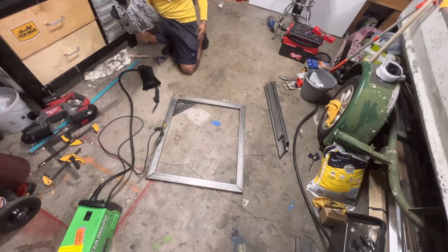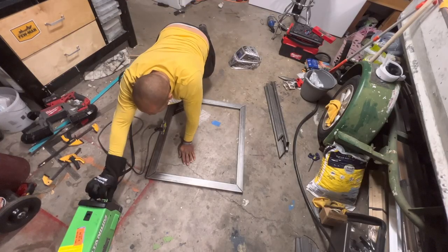Also, the light emitted from the welding, the super bright light, that's all just UV rays. So if you do not wear a long sleeve shirt, you will get a serious sunburn. And if you do not wear a welding helmet while you are welding, then not only will you start going blind, but you'll get what's called flash burn on your eyes, which is like having sandpaper on your eyes. It's extremely painful, so I've heard. Just don't look at the weld ever without a helmet.